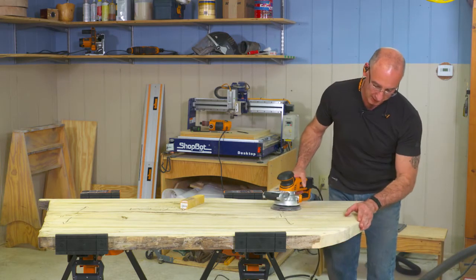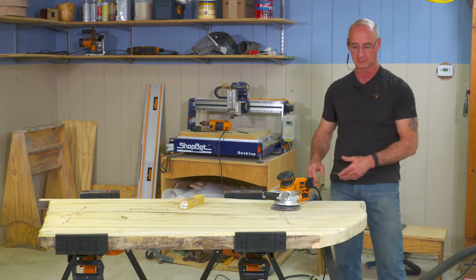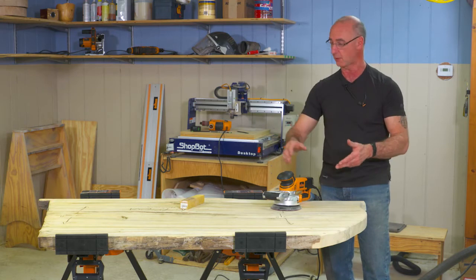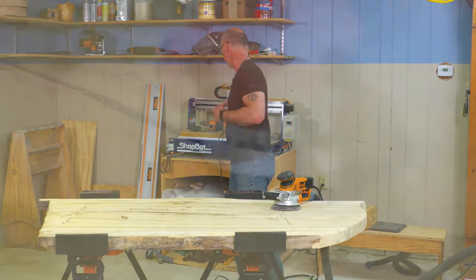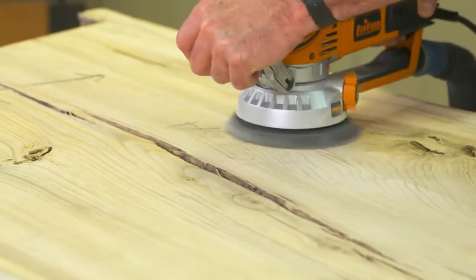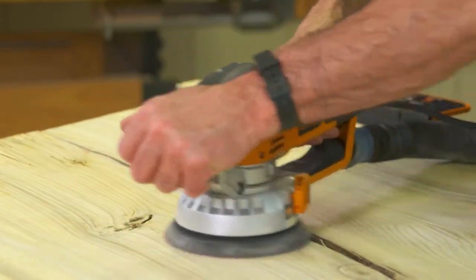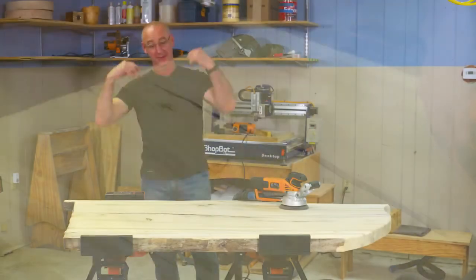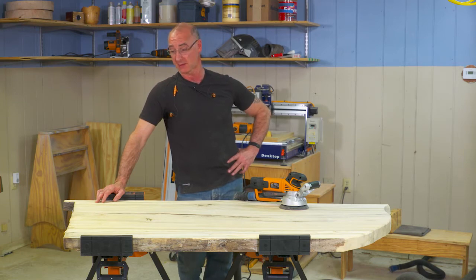I like how that's starting to look. I'll do a little more detailing there, but I'm kind of after this effect of like that's how it came off of a chainsaw or something — something that's a little rougher looking. On the top of this, we can stay initially in that more aggressive mode because I've got to get the marks off of it. There's quite a bit of sanding to do, and then I'll transition back to the fine sanding mode as we're sneaking up on finish sanding. I'm only on 80 grit — I'm going to march my way through the grits and then see if I can get some finish on this.